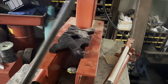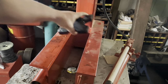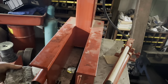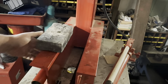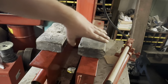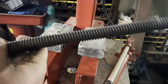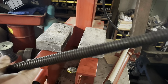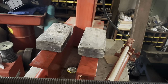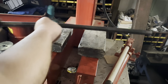We're just giving this a go here. Now, when I use the press to press threaded parts, I always put lead blocks underneath it. Lead is a handy thing to have around the shop. The reason I use it when I push threaded parts is it greatly, greatly aids in preventing the damaging of the threads. These are Acme threads - they're hard to damage anyway, they're flat on top. But for a typical threaded part where it has a sharper edge, it'll bite in, and the lead will give some protection there.